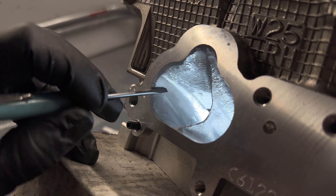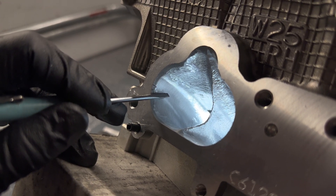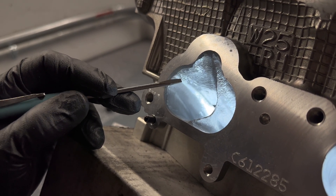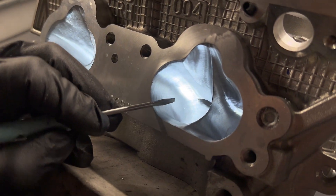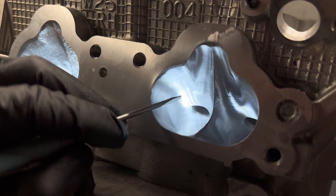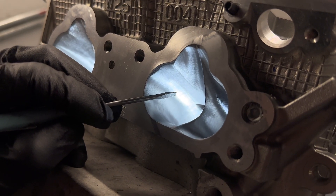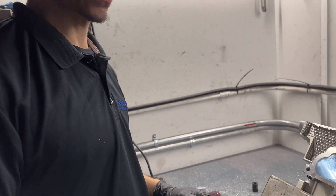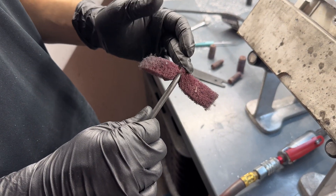After this we move up to a 120-grit and then polish off with a scotch brite pad — that's where we end up getting our Instagram photos, Facebook ads, and stuff like that. This side here, this is after the scotch brite and everything, so this is primarily where we would have our guy come by and take photos. Afterwards, what we end up doing is take a little flapper wheel of 120-grit or maybe even 220-grit, put it in this little butterfly mandrel, and do the same thing we did with the scotch brite.